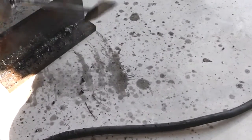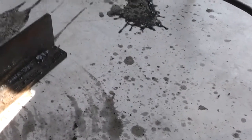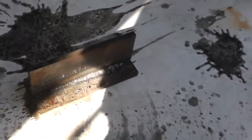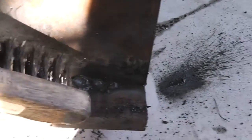It did. It's kind of weird because you can feel it rolling. You wire brush it? Yep. Just keep rolling it all out. It's a little cold, it looks like. Actually we've got fusion — it's a little caterpillared. See over here it started going a little better. Let's raise the temp and give it another shot.